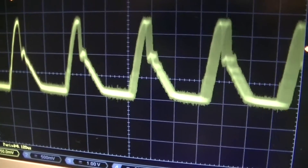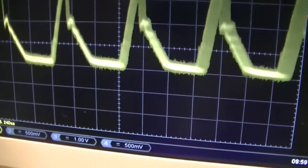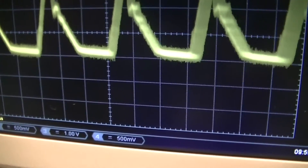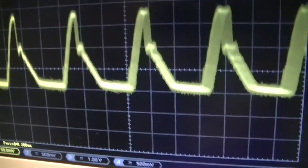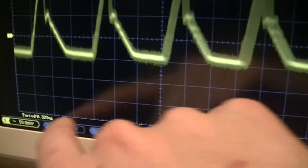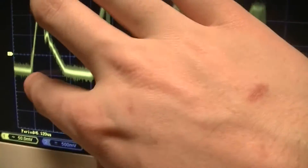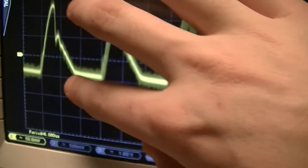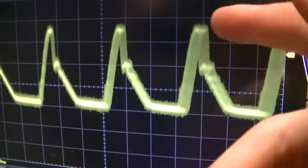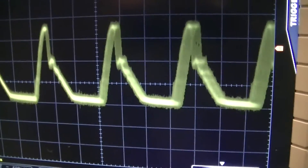And this is the performance of the power supply into a roughly 350 milliampere load, which is normal for something you'd see charging off of USB. And it's generating noise at about 160 kilocycles, which is about a fifth of a volt of noise on that rail — which is not good. You can see it's all janky; the frequency is rather discontinuous as you can see with the intensity grading.